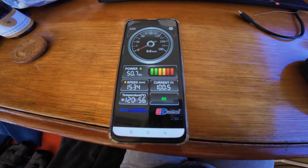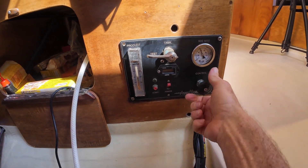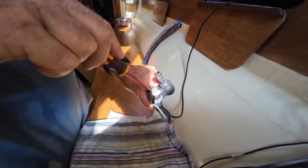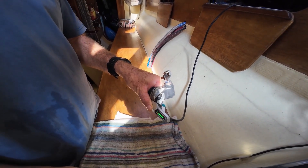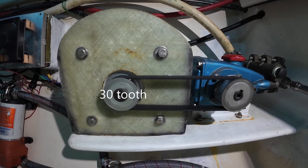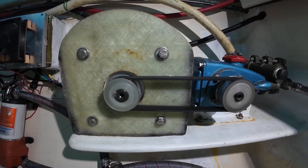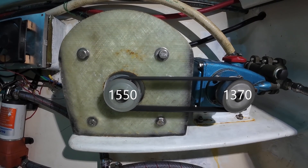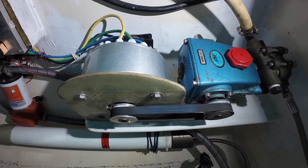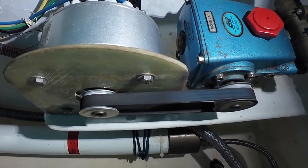It's hit 120 degrees now, so I'll go and turn it off. We've had about half an hour running there, so we've made about 45 litres. Time to shut it down — pop the pressure off, loosen that off, and let the RPM drop down. The electric motor has a 30 tooth 5M timing belt pulley, while the high pressure pump has a 34 tooth pulley. This gives a ratio of 1 to 1.13, meaning when the motor is at 1550 RPM, the pump is at 1370 RPM. This is technically a bit slow for the pump, but our system seems to work nicely like this. I have the 15mm belt running, but I have broken one and am moving up to the 20mm belt.